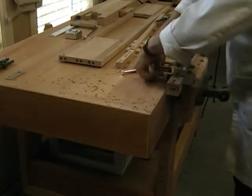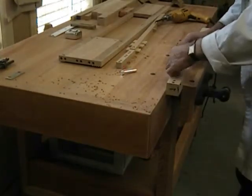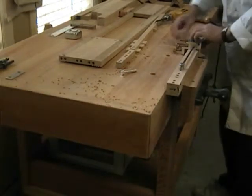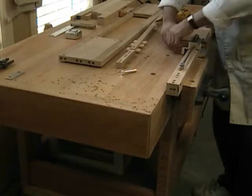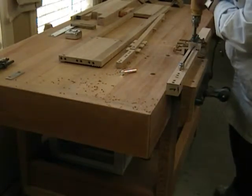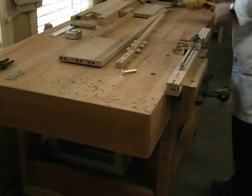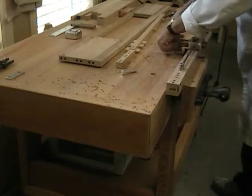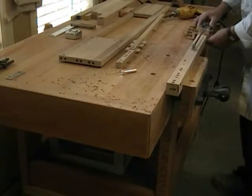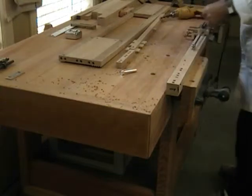I like to do these in several passes to get rid of the wood chips. The distance gauge has already been set, as it has been done for the inner vertical. Now we set that here — we don't need much support here, we just need additional positioners. I'm going to drill number one and just repeat that again. Number one again.